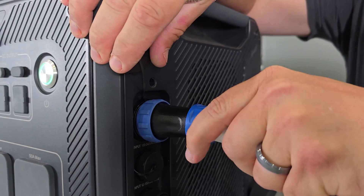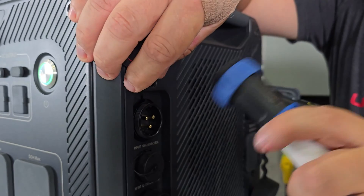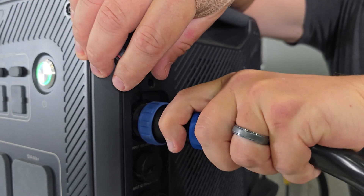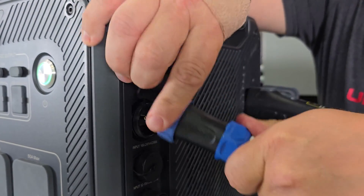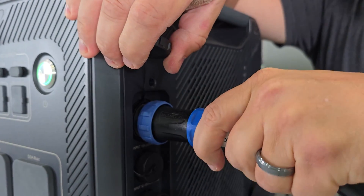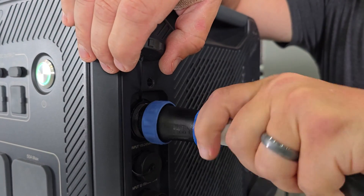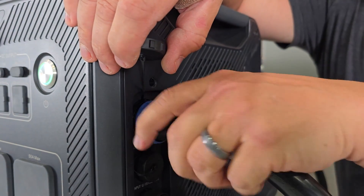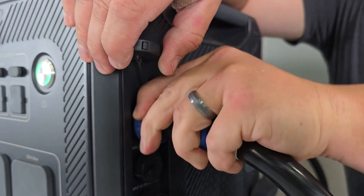This arrow needs to be facing up. We could put it in like this right here — it goes in and you can screw and tighten it down. However, you can also put this in incorrectly. You can push it in the wrong spot and it goes in — see, it's going in the spot, and you wouldn't want to do that. Although it feels tight and on a 50 amp connection you'd think tight is right, it needs to slide in effortlessly. So arrow at the top, put it in, tighten it down.